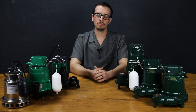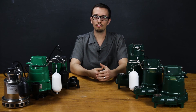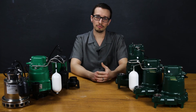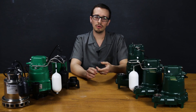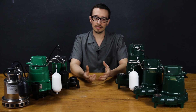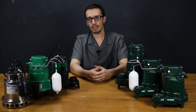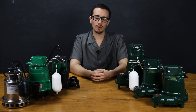The first thing that comes up quite often in conversation is: my sump pump died — should I just replace it with the same pump I had previously? That's a loaded question because you've got to take into account a number of different factors: the cost of the sump pump, how long it lasted, as well as whether the performance was up to what you need — meaning the pump's ability to either keep up with or potentially over-pump the application.